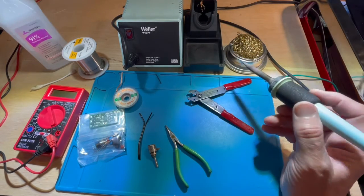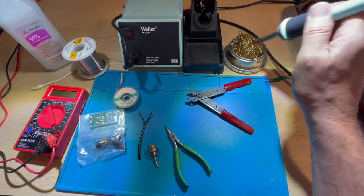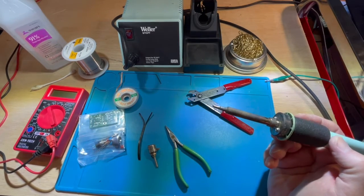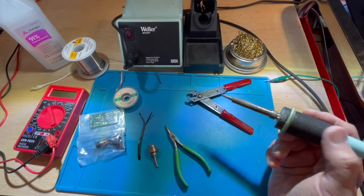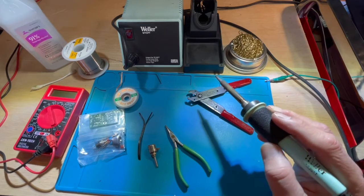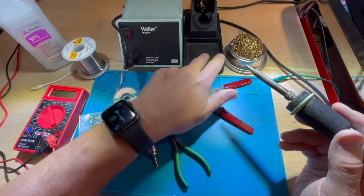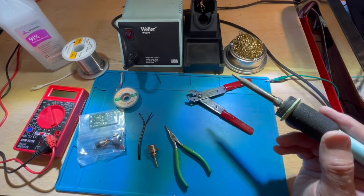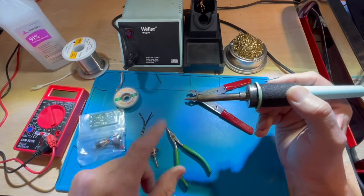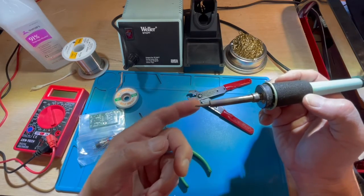Also, when soldering, you'll see me very often clean the tip just by going over here to this brass coil assembly in order to clean the solder off the tip and keep it nice and clean and bright and shiny with fresh solder. Doing so helps you really identify a good solder joint. Some people, by the way, use a wet sponge in this type of little area, which is okay to clean off the tip, but I prefer not to because that pulls temperature up and down off the tip and tends to wear it out a little bit sooner than it otherwise wears out.